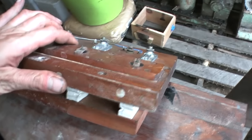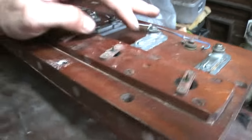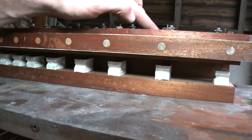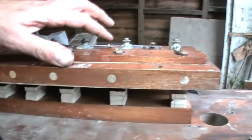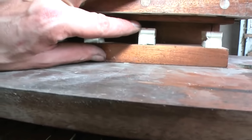Each one of these magnets, when it's energised with the action voltage — which will be around 15 volts — there's an electromagnet coil down in there. When that's actuated, it opens a little valve in here. Normally it's in a position where wind goes from inside this chest, passes through here and inflates this little leather pouch. So that's the normal off state — it's fully inflated. When you energise this magnet, it flips over the little valve, pulling it down into the magnet and opening this exhaust port here.